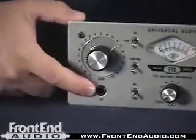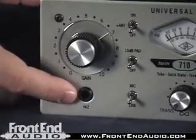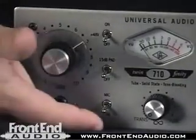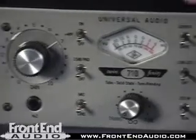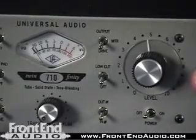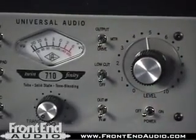On the face of the unit, we've got a quarter-inch instrument jack. The unit's auto-sensing, so when you plug into it, it'll automatically switch to the DI. We've got phantom power switchable, a 15 dB line pad, and switching between mic and line inputs off the rear of the unit. We're able to monitor our input drive or our output. We have a low-cut filter which is set at 75 cycles, which is a good point. And we've also got phase reversal and our power accessible off the front of the unit.